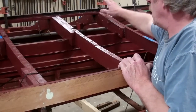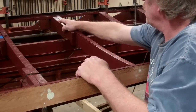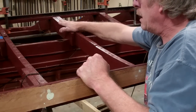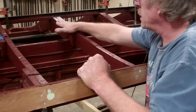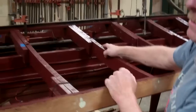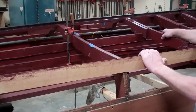That intermediate frame is not hooked to a frame on the side, but it allows a little bit more structure in between the main frames. Therefore, when the boat's right side up in the water with a lot of weight and going across the waves, there's a lot less give in the section where there's so much structure, compared to the back where they didn't put the intermediate frames in.